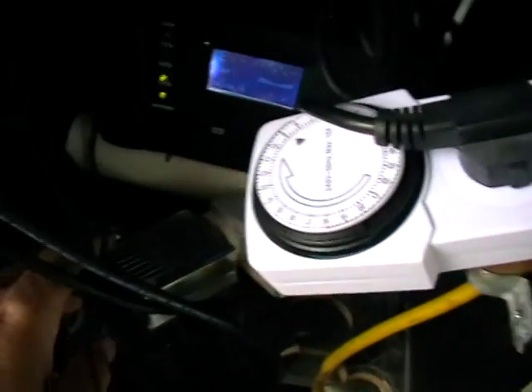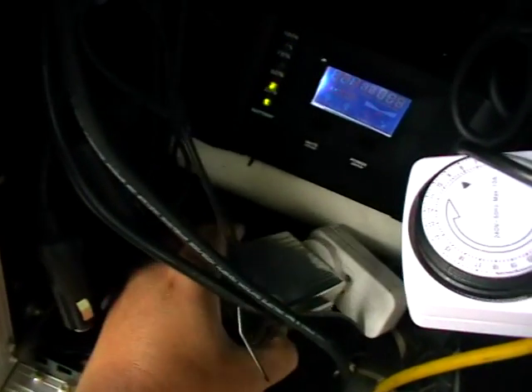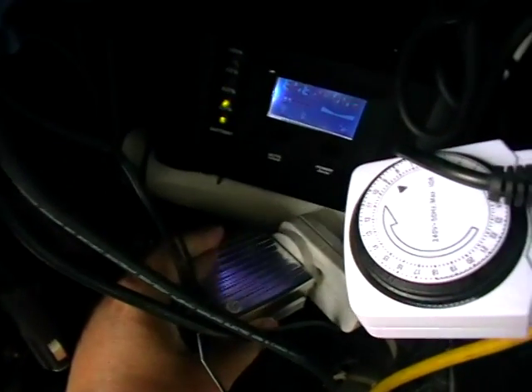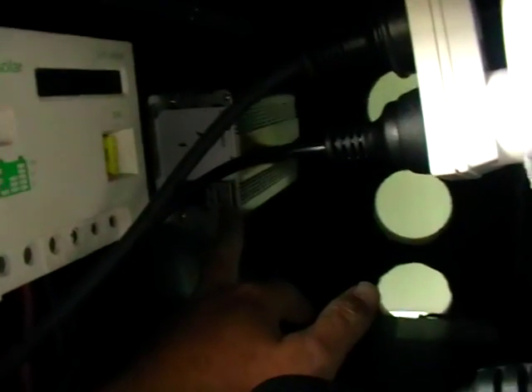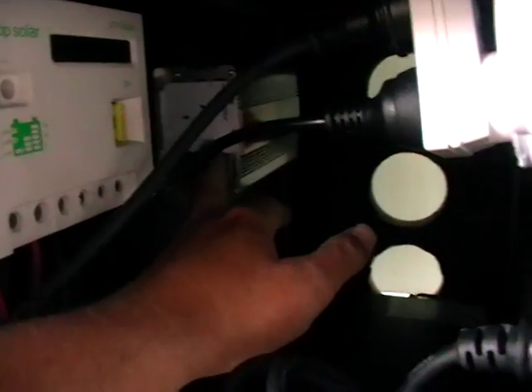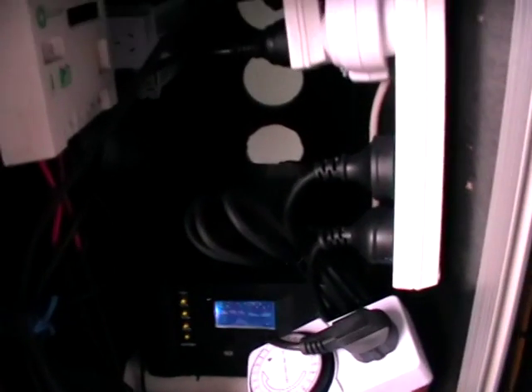With this system I try not to run too high an inverter. The inverter basically running the air pumps is quite small — about an 80 watt inverter — and it's not even warm, so there's not a lot of wasted electricity. In any aquaponics system I never want to lose my fish and stop the water pumping, so I basically have a backup failsafe for everything. There's an extra inverter up on the wall — about a 300 watt inverter — which can be changed over in about three seconds. So if anything fails — any controller, panels, or batteries — I can swap over. I'm not off the grid, so I could just plug into the power point, but I'd rather play the solar game.